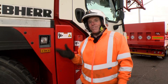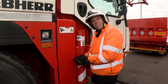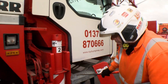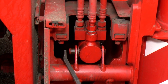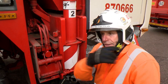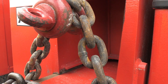We talked earlier about how to get these legs out if the vehicle isn't under its own power, in order to wrap chains around them. There's a panel here with small allen bolts that come undone easily; once you've taken those out, the panel lifts off and out of the way. Inside there's a pin running through the ram that pushes the leg in and out. If you take the circlips off and knock that pin out, there's a gap underneath where you could use a small port-a-power ram — or, if you have another machine alongside, run your drag winch around the bottom of the leg and pull it out. You only need to pull it maybe a foot or so, but that'll be enough to get your chain around it.